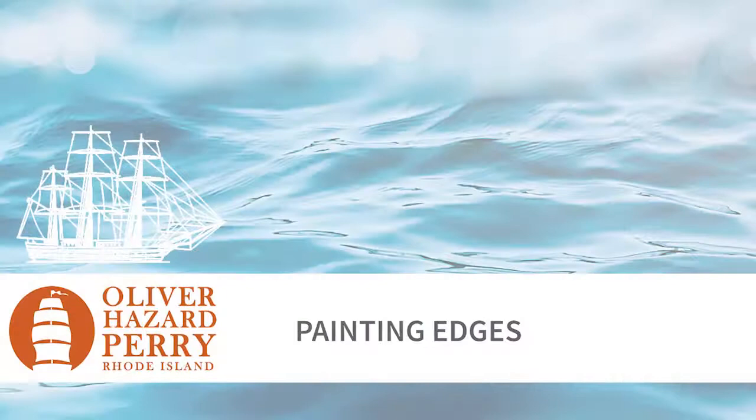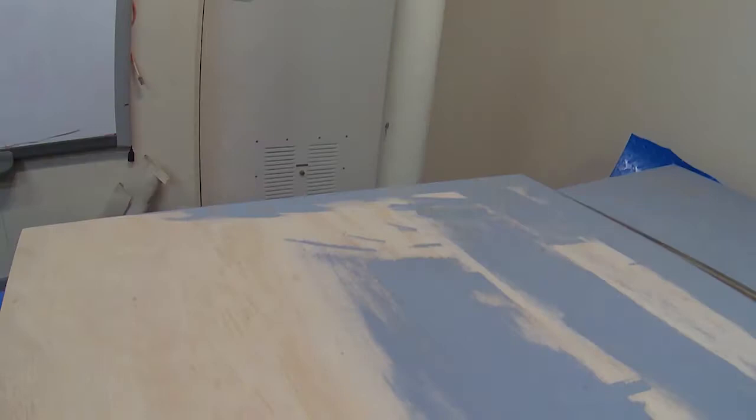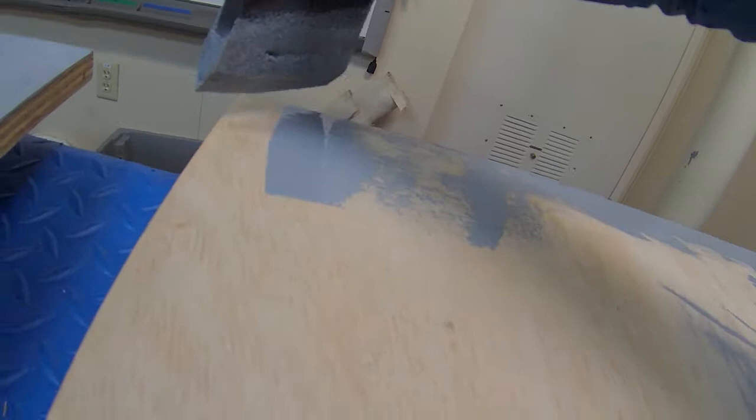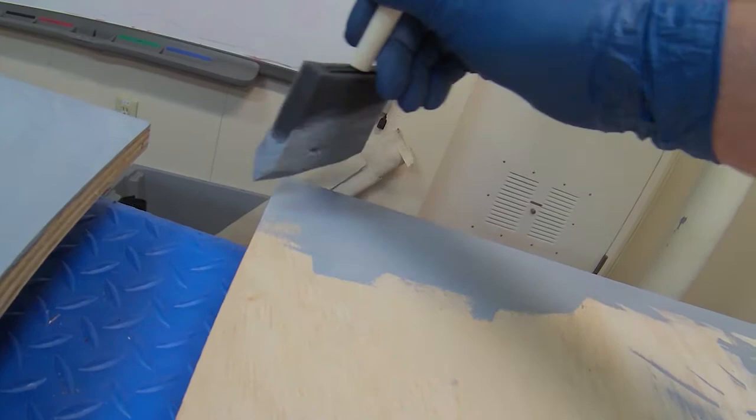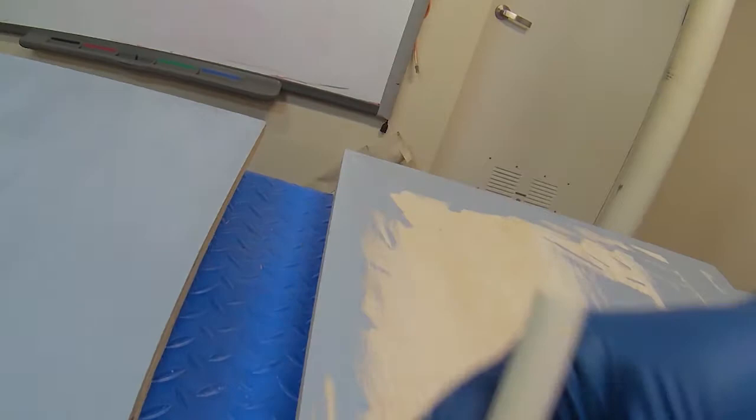I always go across the edge with the brush at an angle — not straight across, not flat across, but at 45 degrees. At 45 you hit the best of both worlds. If I go straight across you can see all those little bubbles where it missed. At that nice 45, those bubbles disappear and you're in the grain. Running down the edges with long, smooth strokes as always, give yourself at least an inch of space so you've got somewhere to take off and land.